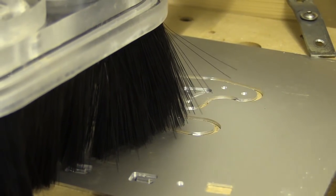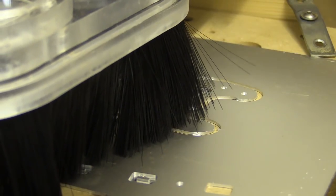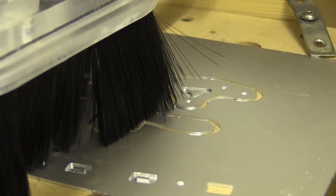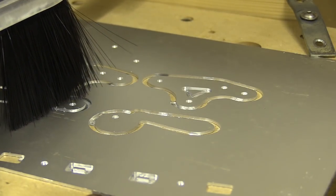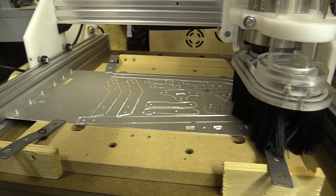I'm cutting at a step down of 0.2mm with a 1/8th of an inch bit, at a feed rate of 200mm/min, a plunge rate of 80mm/min, and a spindle speed of 15,000rpm. Of course, if you don't have a CNC machine you could also use the other type of CNC machine — a printer — to produce templates which you could stick onto the material and then cut out.